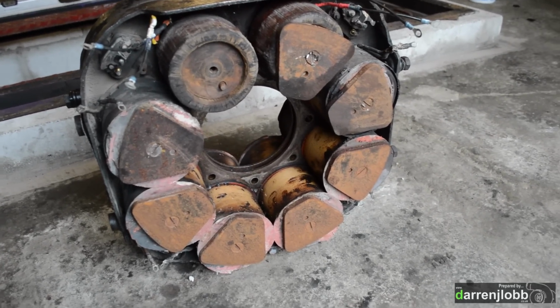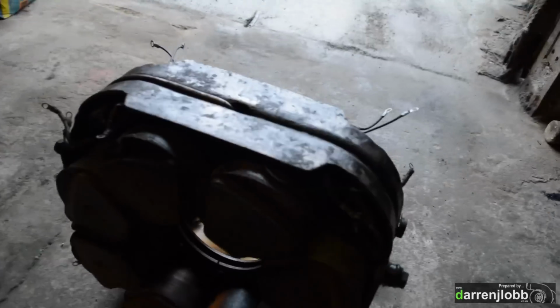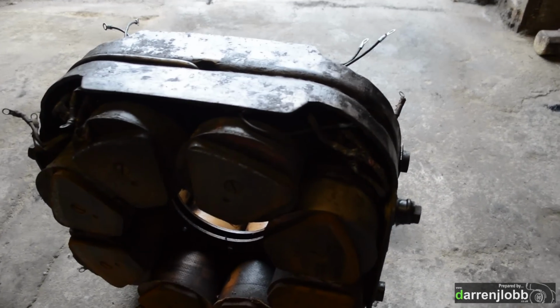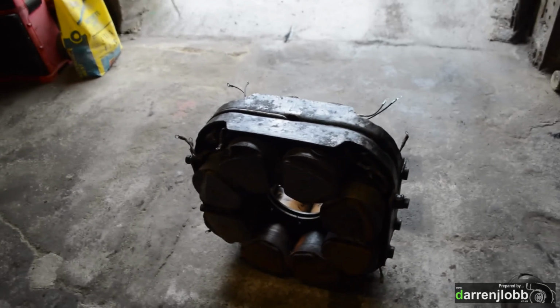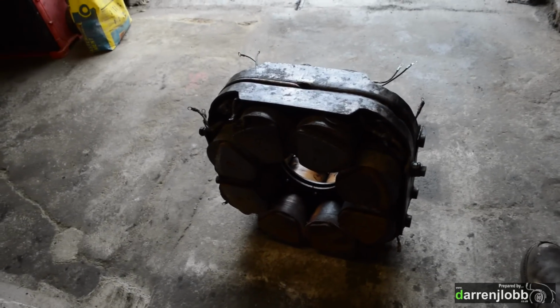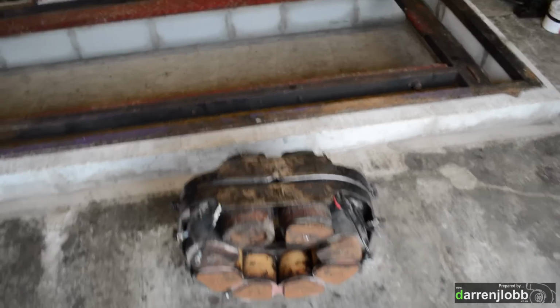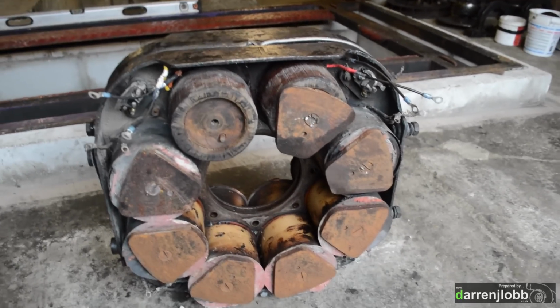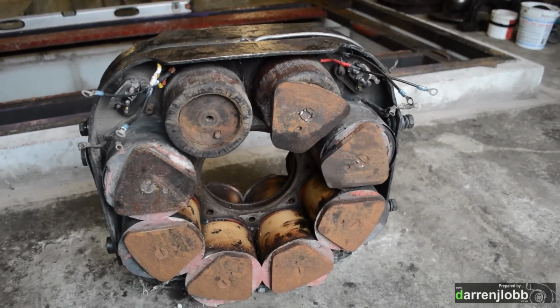So we've crimped them. There's also a couple of old existing coils where the wiring or the crimps had corroded, and it's a bit dark to see, but we've also had to crimp in repairs to these as well. So we've now tested every single coil, and as of now every single coil is working, which is great news, because we were thinking that we were either going to have several coils rewound, or maybe even everything rewound, or even looking at buying a different brake. But it's looking like for the time being this one's going to be more than salvageable.